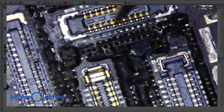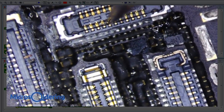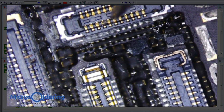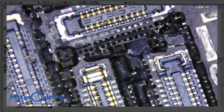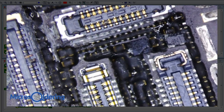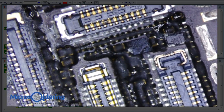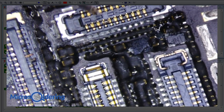So I think probably just start removing stuff. We can check for shorts. Those look like there's actually something in there, a piece of solder or something. This little ffleck of solder could very well cause a boot loop, and that's what it's doing. It went to 0.43 and then it just quit. So let me look for my little tool. You can get a pin too. I'm just going to pick this out.